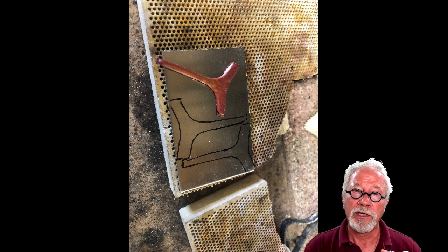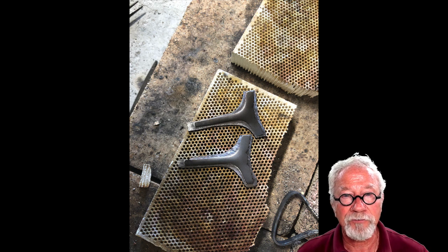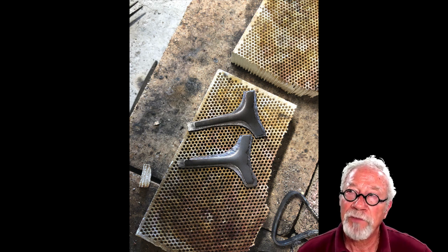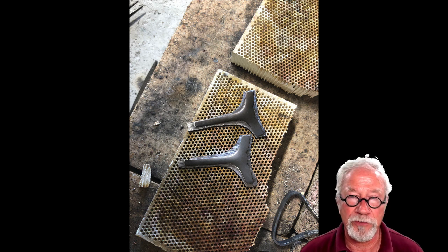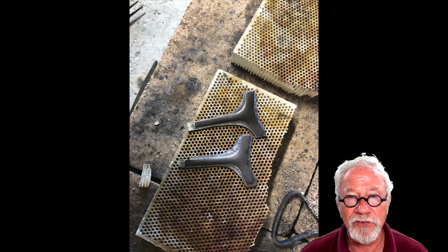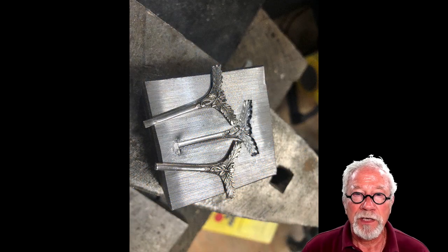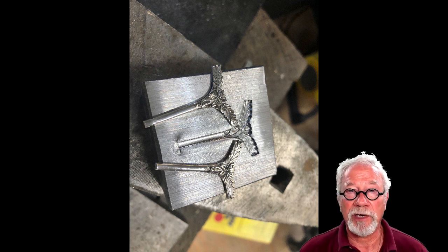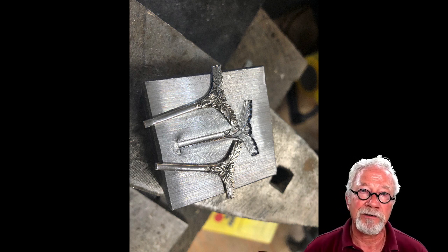These are wonderful. So what you do, this one I used a copper frame to cut out the metal up to approximate the size. And after that, then I pressed it first, and then you trim the flashing, and it took three pressings with repeated annealing in this one to get it just right. But that's not atypical for these rings. They turned out really, really sharp. I really liked the look of this design. The leaf pattern is gorgeous.